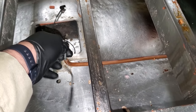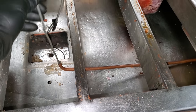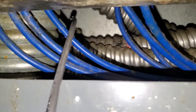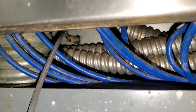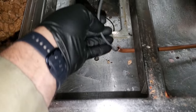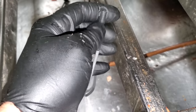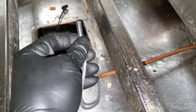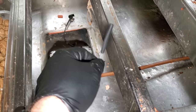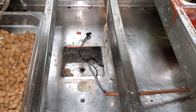I'm going to pull the probe out and push the new one in — we should be able to feed it right through that copper line, which feeds over into the electrical panel. I've got the new probe pushed through. On these new ones, you've got to be careful because the ends aren't hard anymore — they used to be hard and I've actually broken sensors on the new ones, so be cautious because they're soft and they'll snap. I'm going to get it pushed in, get the fan motor installed, and then before I push it in, we're going to soak that pan chiller and I'll show you how we do that.